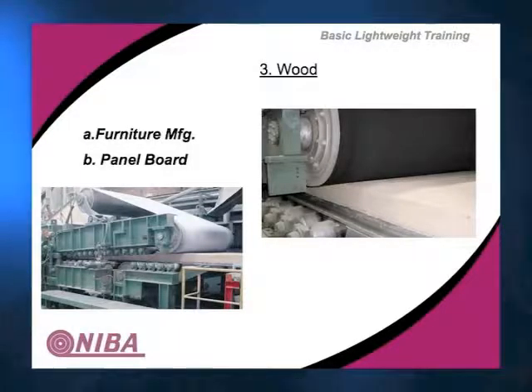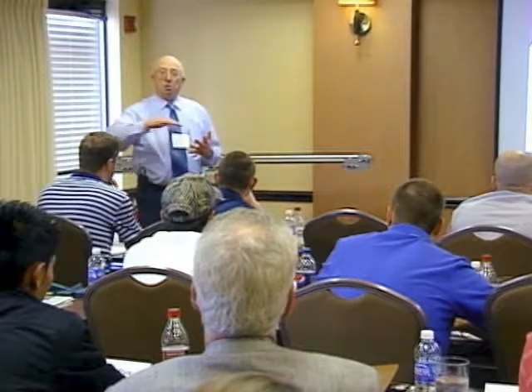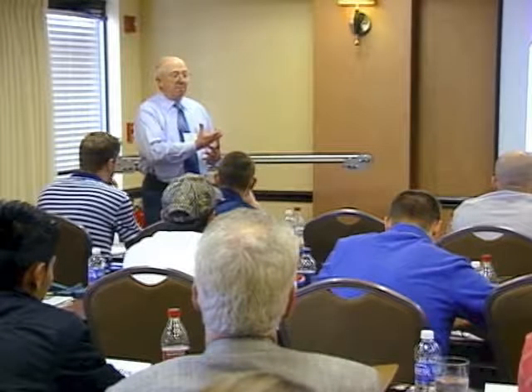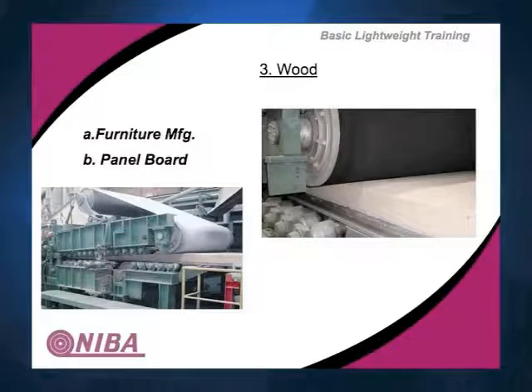Wood industry. There are specific applications here that take different things. In the furniture industry you're talking about smaller pieces, finished board. You've got wide-belt sanders — one application with several different profiles. There are applications where they're running through a varnish or lacquer machine, for cabinetry or anything else where they're putting a finish on it. You've got to have something that gives good release and cleans relatively easily because the varnish and lacquer doesn't just stay on the wood — it overflows onto the belt.